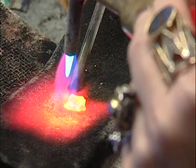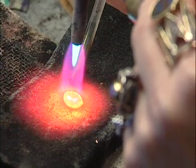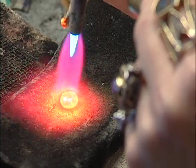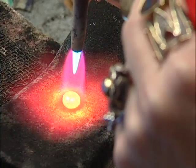I'm just heating it on a charcoal block — a compressed charcoal block that has a little bit of a depression in it — and just stir that around just a little bit. Now the little things floating on the top are the impurities coming to the surface. Once you see those, you're done.